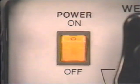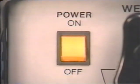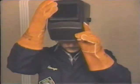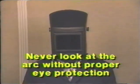Turn the welder power switch to the on position. This will supply power to the rod holder. Put on your welding helmet and lower the face shield in front of your eyes. Never look at the arc without proper eye protection. To strike your initial arc, bring the welding rod into contact with the work surface with a similar motion to striking a match. This will remove the flux coating on the end of the rod, exposing the metal beneath.